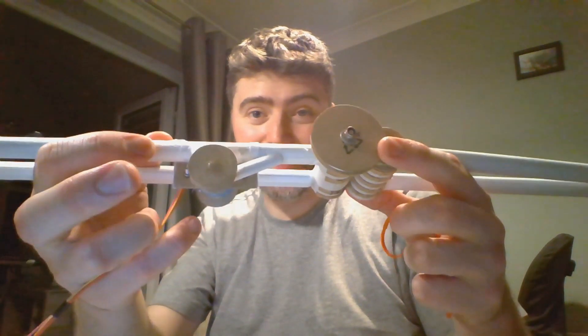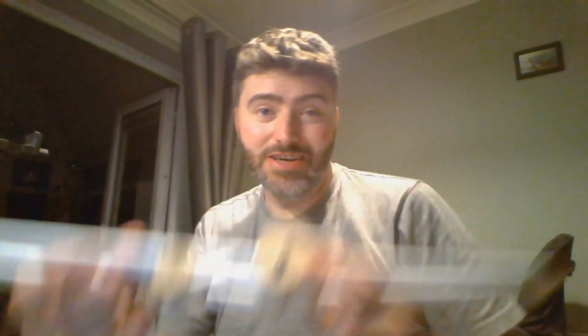You can see it's actually moving the pulley. I obviously made a mistake: this pulley should have been the same size as this pulley, and it isn't. So it's actually having to do almost twice as much work just to move that, and it is something I'll have to address in any future version.